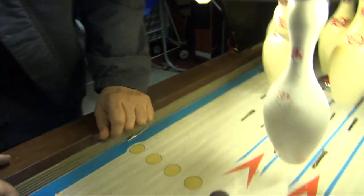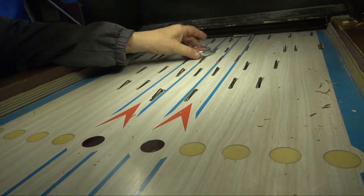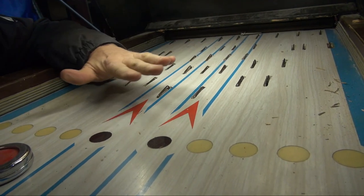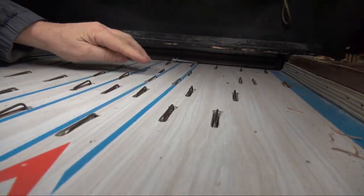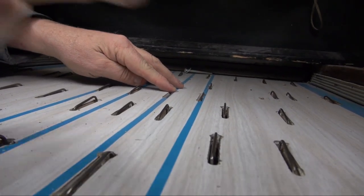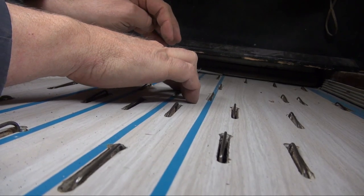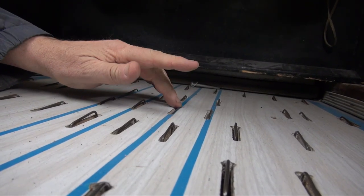Okay. The number three biggest problem with the shuffles. Actually, the number one problem, these are additional issues you could encounter, are these rollovers themselves. If you have a problem with your game, before you call us, sweep all the pins out of the way and eyeball all the rollers. They all should be about the same height up. If one of them is down a little bit like that, take your index finger and work it until it pops up again. I didn't use my middle finger.